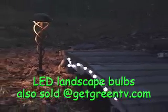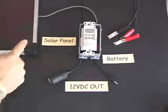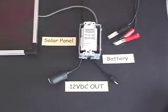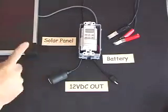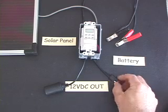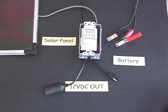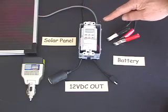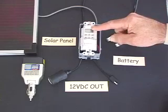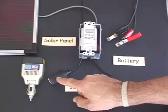Okay, let's get busy. I've got to show you how to build this thing. What I'm trying to do is create power. In this case it comes from a battery, represented by those black and red clips. The power to charge the battery comes from the solar panel. We get 12 volt DC power out of the battery through a car-type cigar socket and this weatherproof low voltage connector. This panel is self-regulating so it hooks directly to the battery. This timer allows us to limit all power consumption to maximize our capabilities. This gives us our AC.